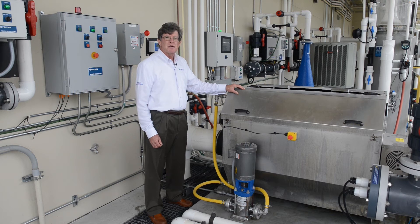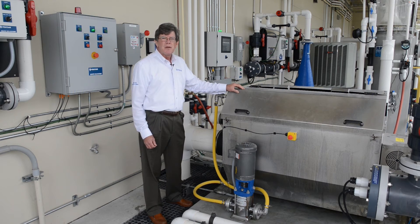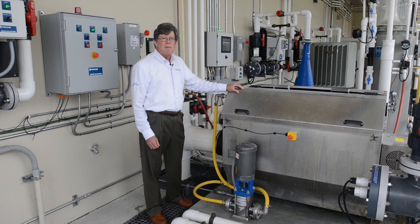With a 60 micron screen, the larger the screen size the less water the system will use. This is also coupled with our Berkeley pressure pump — for this model it happens to be a one and a half horsepower model. It is automatically controlled by the controller behind me, so that as the water comes through, solids build up on the inner surface of the screen, and when the screen backwashes, the pressure pump provides pressurized water to spray the screens and clean them.